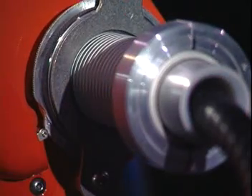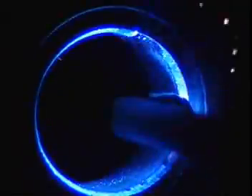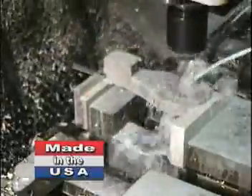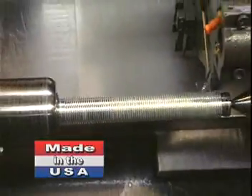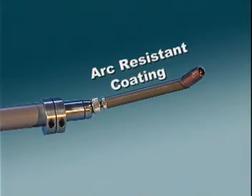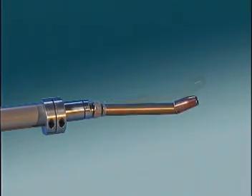Auto weld skip is a standard feature on the 450HD and comes as an option on the 308i. The Boa 308i's fixed mechanical feed and the 450HD's variable mechanical feed ensure accurate weld bead placement every time. Incoming voltage fluctuations have zero effect on Bore Repair System machines' feed rates. System components are machined to high tolerances with few moving parts. The Boa is an accurate and reliable addition to shops, mills, and plants. The Boa's torch body features an arc-resistant coating, and the torch assembly includes a locking swivel mechanism.